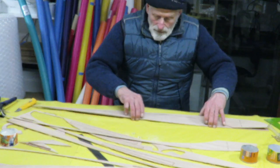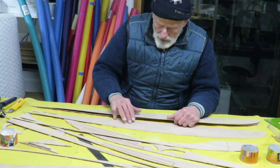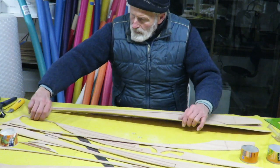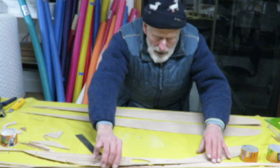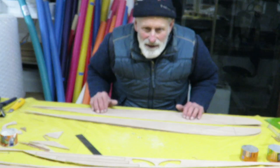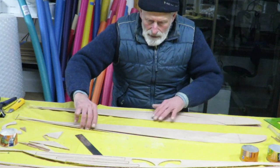Now we're ready to glue things together. Since these pieces are bigger and more likely to twist, we're going to weight the pieces down so the glue joint holds them totally flat. Check how your doublers are going to fit — mirror images, remember. The bottoms haven't been assigned inboard or outboard yet, so choose a perfectly smooth side for the outside bottom. Keep repeating mirror images — somebody will call someday saying they have two starboard bottoms.